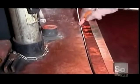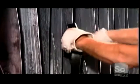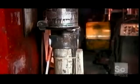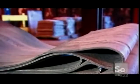They write the ID number on a sample of the rubber and tag the production run with the same number. This signifies that testing is underway. They tuck the test sample in a canister and send it up a chute to the lab. Once it's confirmed the rubber has the right characteristics, it's ready to be made into the various components of a giant tire.